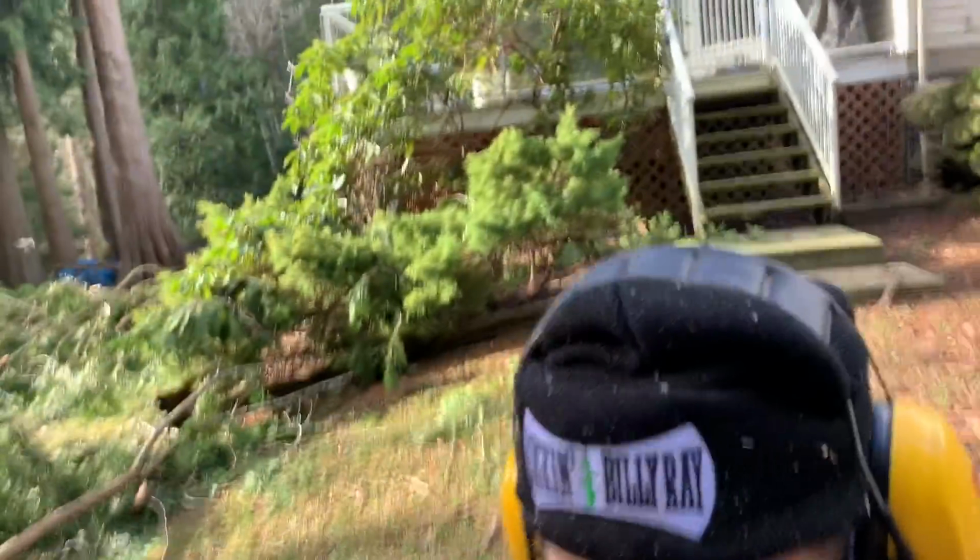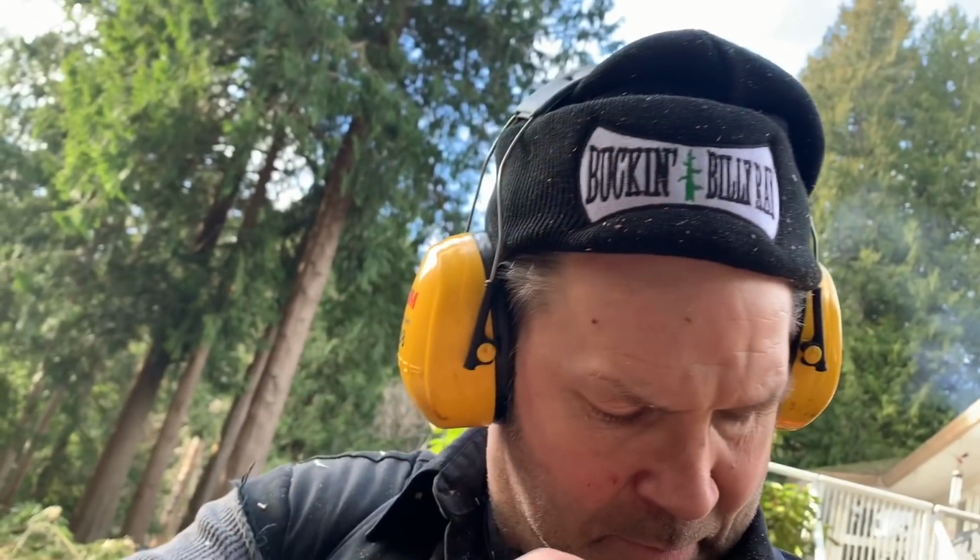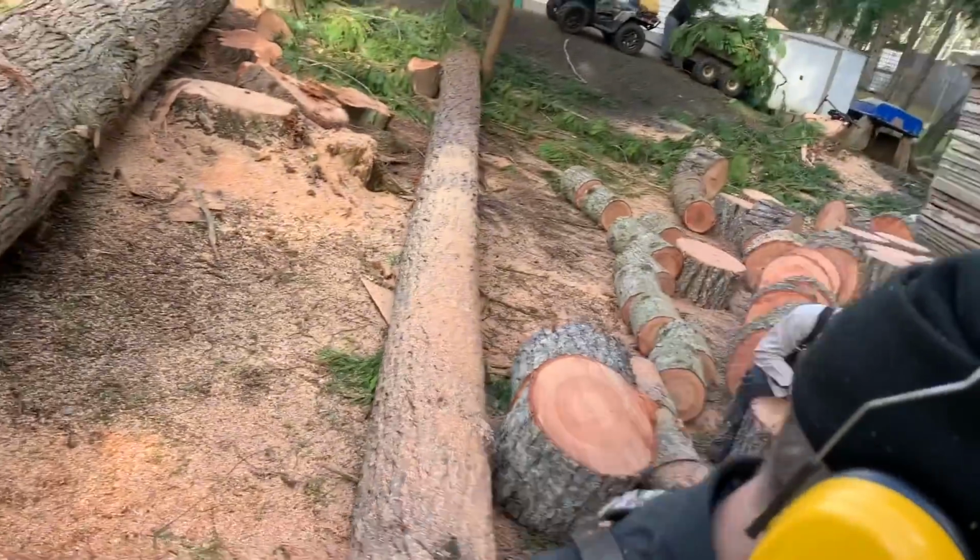Donnie Walker, here's the deal. Listen, friends, with these 572s that I've seen, from what I can understand, you got to leave them up in their high revs, or they're going to run out of fuel when you load them up. They don't take the load that well. Just keep the thing singing.